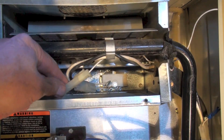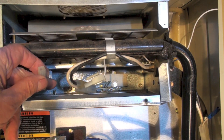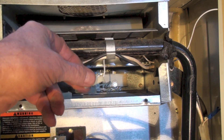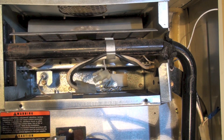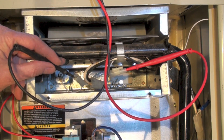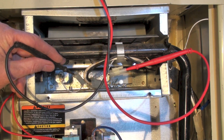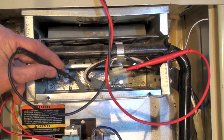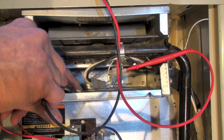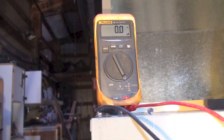In order to test this, I'm going to pull this apart and put my meter in there. It's not real simple to stick the meter in these things, but you can do it. The way I've got this set up, I've got one probe here and the other probe here, and I've set my meter to microamps. I'm going to try to jam them in there.